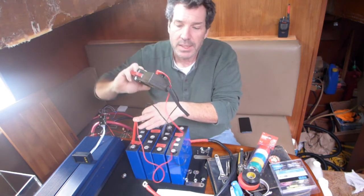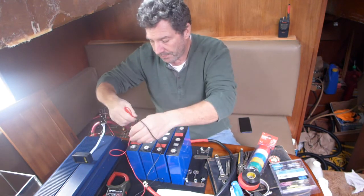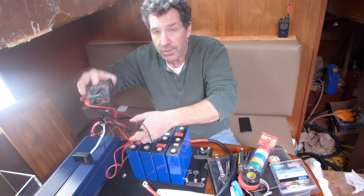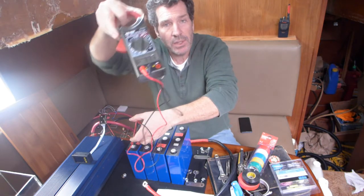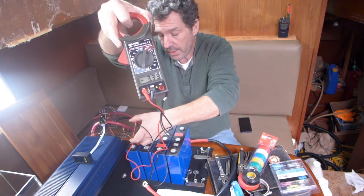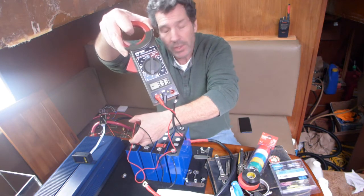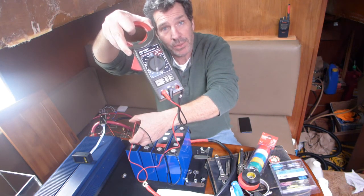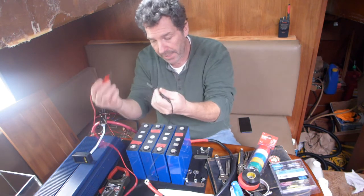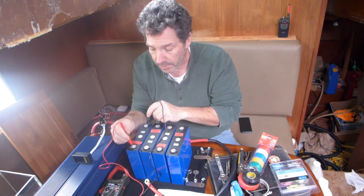You can see that it's 3.34 volts in this cell. If I swap the leads, it says 3.33 now, but also there's a negative sign — that means my probes, the red and the black one, are in the wrong connection, the wrong side. That's how you tell which side is positive and which side is negative. If you have a negative sign, your red and black are wrong — go ahead and swap that back. That is the red tape for the positive there.